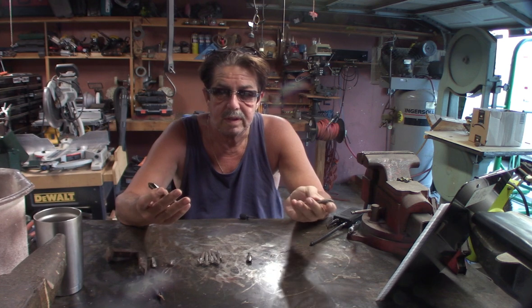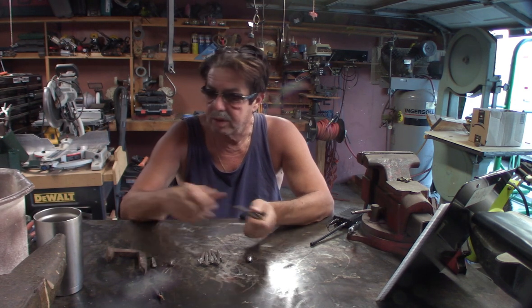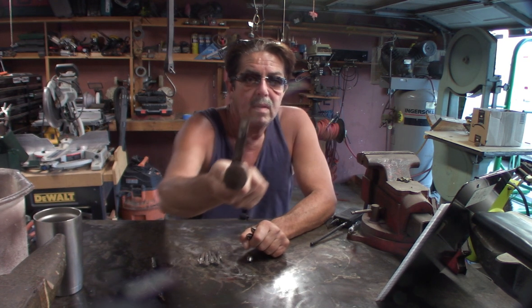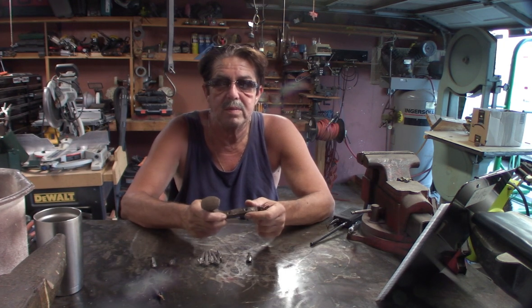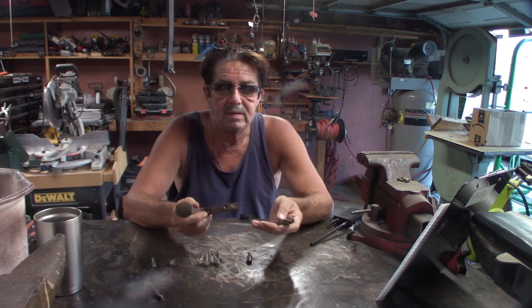Irwin is just my choice — I'll leave the link below. When using these on metal as I've shown in previous videos, I always drill the hole first, then come in with this to create the chamfer. It's got a nice finish and a nice clean cut. Just take your time, don't let your bits heat up, go slow speed with good cutting oil.